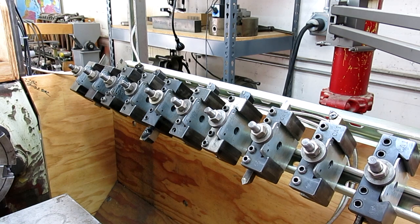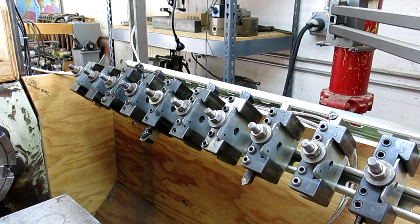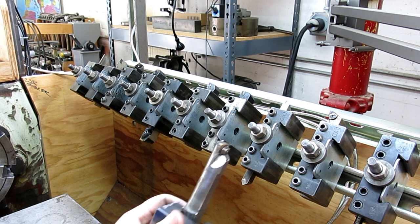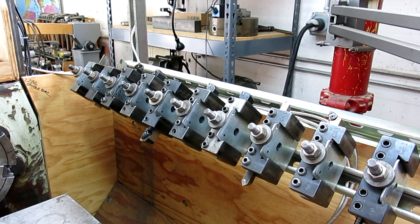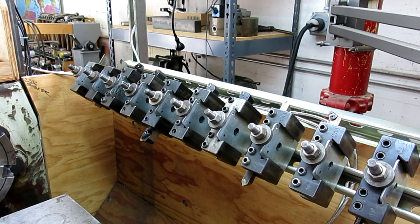Okay. And same thing here. A little bit bigger one. And carbide shank boring bar. So we'll put that little monkey in there. And then this is triangle. So it's a T. Now this is a TP something because it's positive. Okay. The insert seat's flat. This one works good on steel. All right. What else we got over here? Keep on going. So here's a little hand ground job there. Little V-groove looking thing. I was doing some profiling with that the other day.